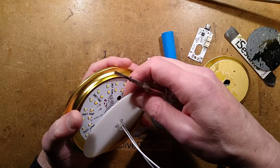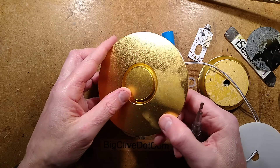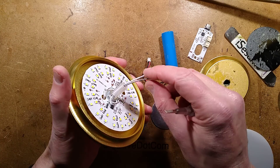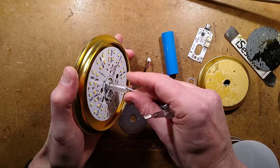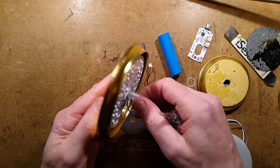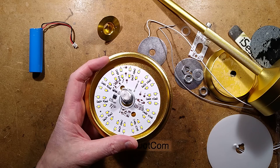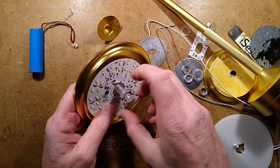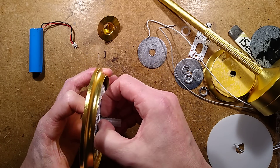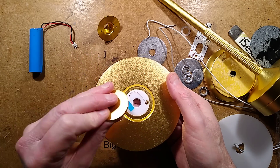The circuit board is just wonky — it's right off-centre in here. The touch sensor is going up to this little metal plate at the top. Is the metal plate properly isolated? I see they've got the wires running up here and they've drilled a hole in the side where it comes through. That means I can't really get that nut off. I'm going to have to desolder these wires and pull this out.